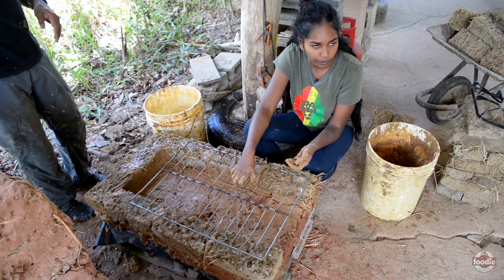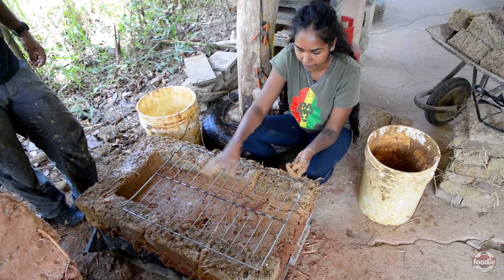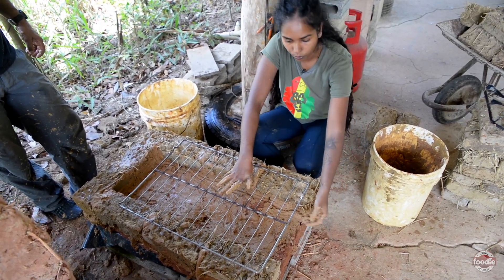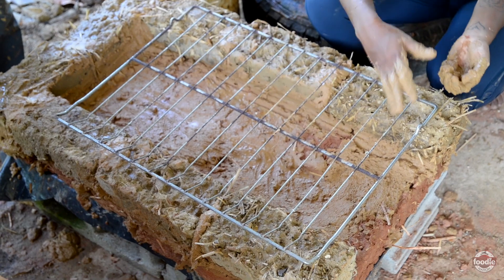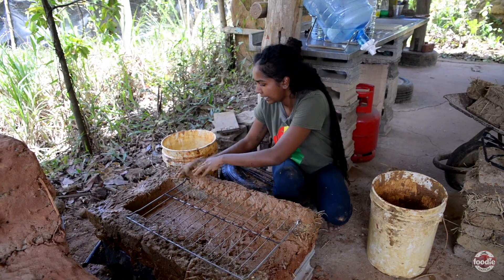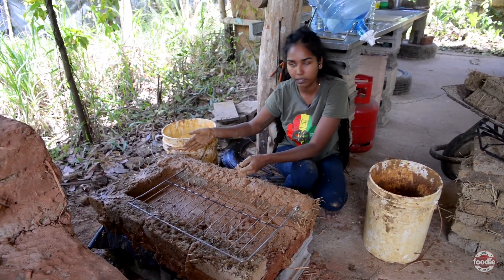We put in this shelf — it's just an old shelf but you could use BRC or anything strong. The area down here is going to be open and clear, and then you load your firewood in on top so that the air can circulate underneath and pick up the fire. You can use the mortar to build up areas that aren't as level because not all the bricks are the same height. I just dunk my brick usually.